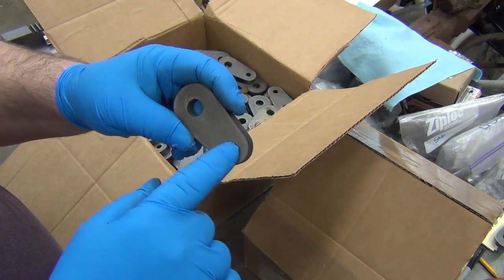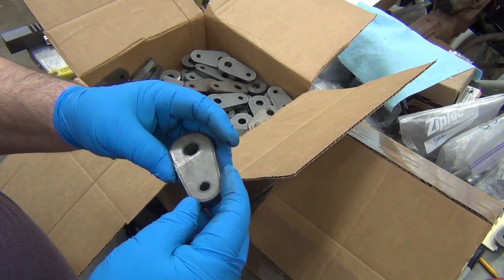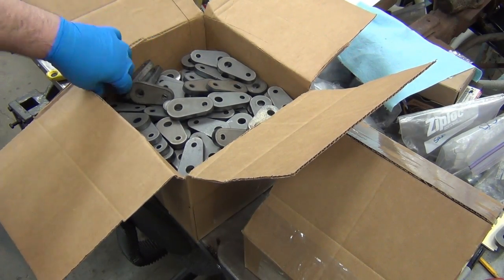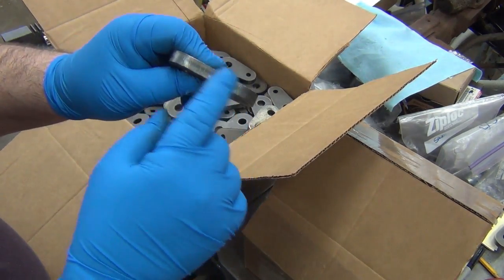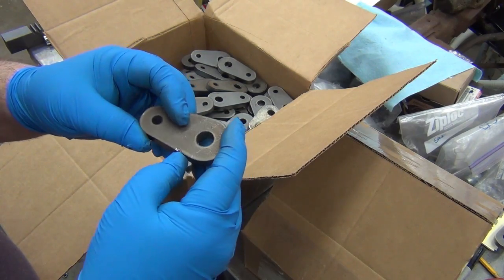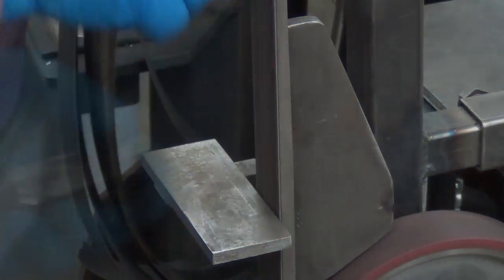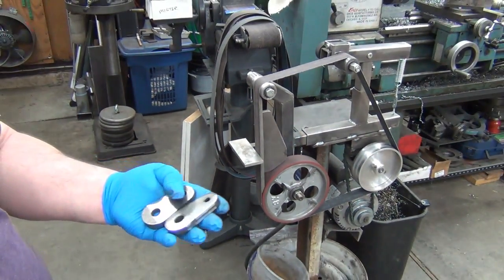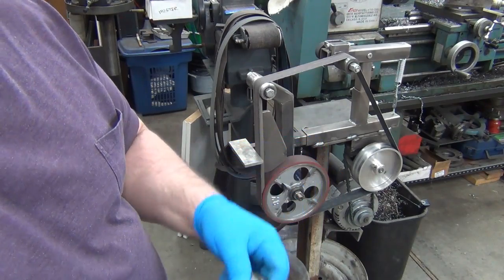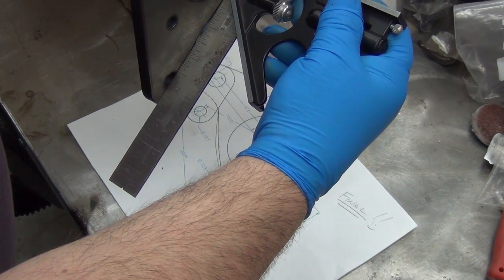Same thing here - I did this as a pilot. This should be a three-quarter inch hole, currently about 10.3 millimeters. So now I can start drilling all these holes - going to make about 10 pounds worth of chips. I'll take it on the belt grinder to knock it down smooth, but I can't really do anything to fill in that divot. The little time here and there does add up when you've got to do like 90 of these things.